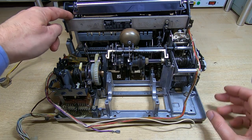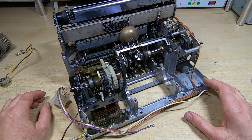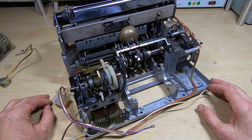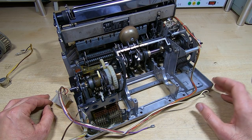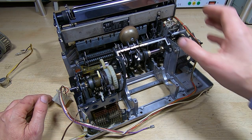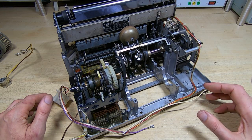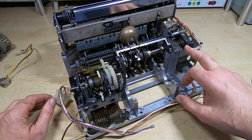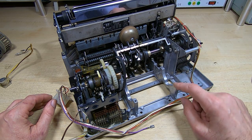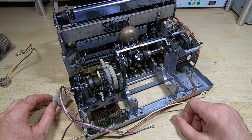What I do is, if I have taken this route, there are various things you can do. You can soak it. If it's a small device, you can dip it into isopropyl alcohol. That will displace the water, and then the alcohol will dry off fairly quickly. Something like this is too big, and also I wouldn't feel confident dipping this into isopropyl alcohol. If you do have something like this and there's a rust on it, don't dunk it into something like Evaporust. That removes any oxide layers, including the black oxide that's protecting a lot of these components.